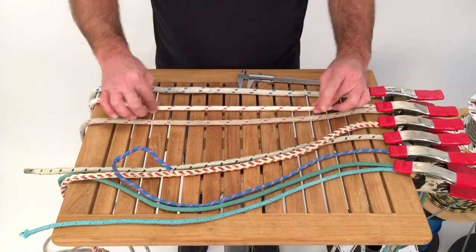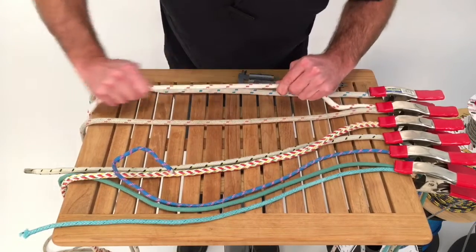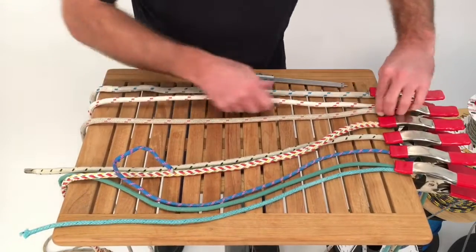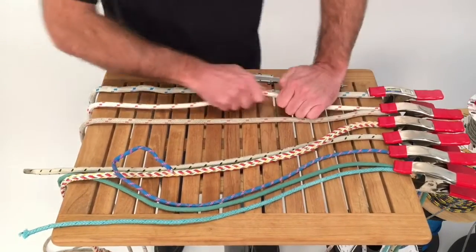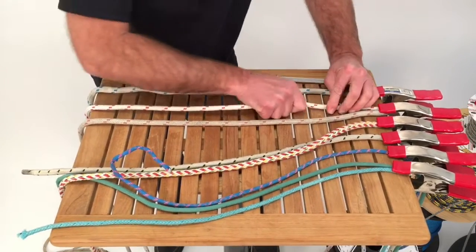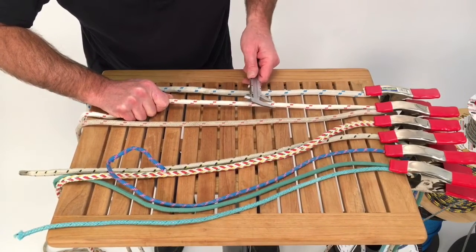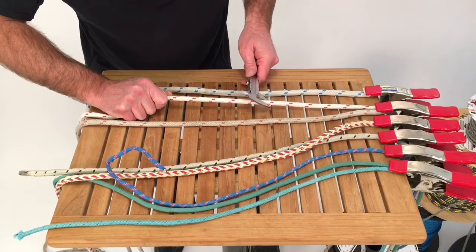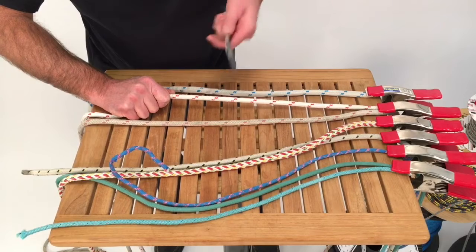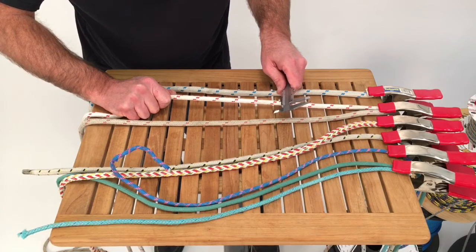I'm choosing to measure this, which is obviously more like its new condition. I can feel it's a double braid polyester. Let me clamp that and pull the core and the jacket, trying to get that constructional diameter down. Open this up, close it up. There we go. Rotate. The line felt round to me, and this one's coming right smack dab on a 3/8.